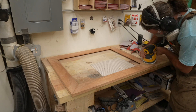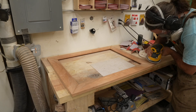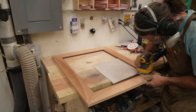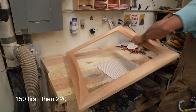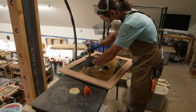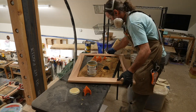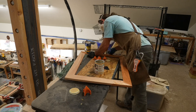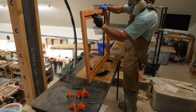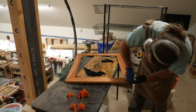Machining with 80 thousandths of a step over left very little material to clean up with sandpaper. I did get a tiny bit of ridges on some edges that I had to clean up, but sanding wasn't too hard. I used my random orbital sander for most of it. For the finish, I opted for Osmo matte finish. I apply it using a white applicator pad to rub it in, then remove all of it until it looks dry with another rag. I let it dry eight to twelve hours, then add two more coats for a total of three coats.